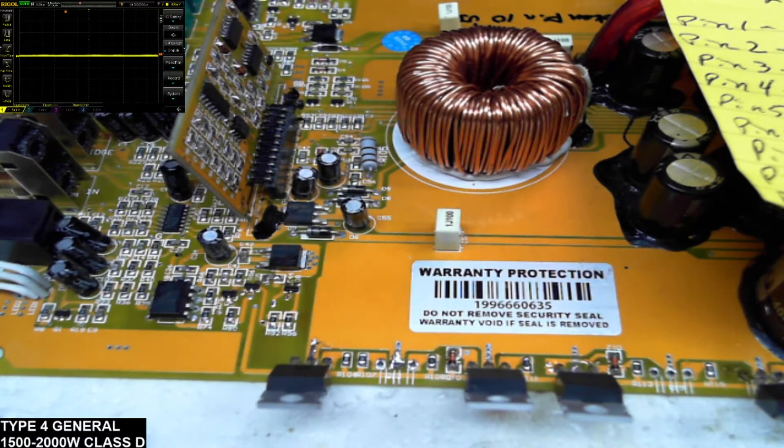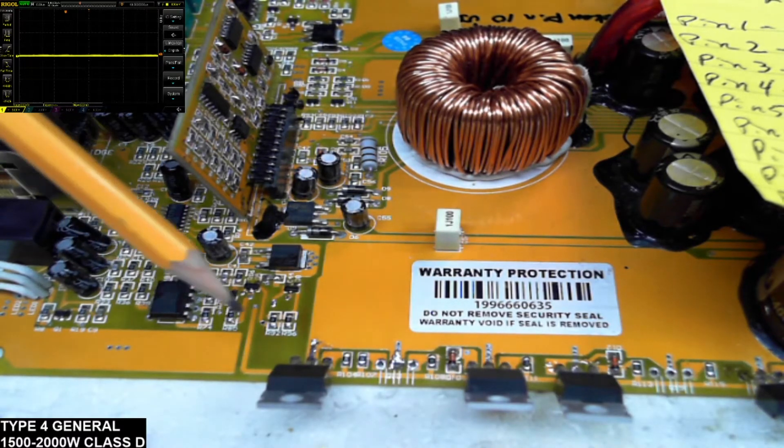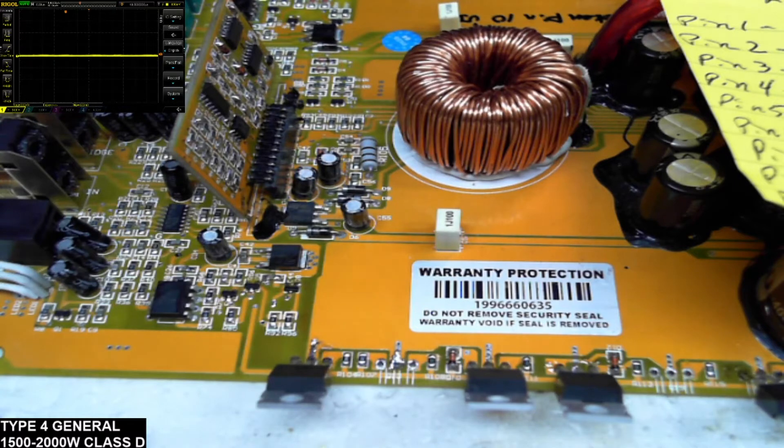I did replace the two T's and two X's on this driver board. I had two shorted two X's on the low side drive, which makes sense when the low side drive got lost. I replaced both sides of the two X and two T's and threw in some 640s to test the drive, since this board didn't come with 640s. For those new to this, these are the IRF640 N-channel FETs that these amps use.